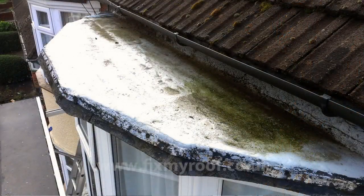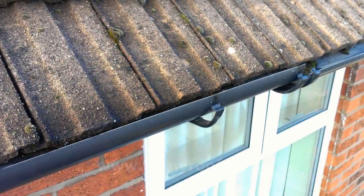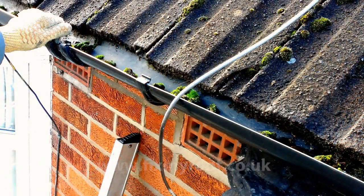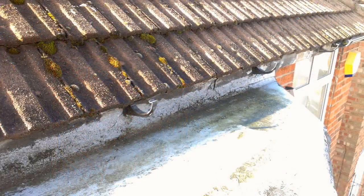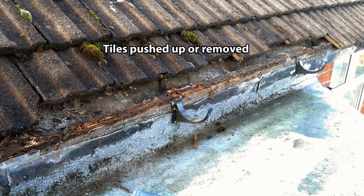It's a job done for a landlord who is very reluctant to spend any money on it. Firstly, disconnect any gutter that may be fouling your access. This is normally just a matter of unclipping any joints or unions with your hands and then sliding out the length of guttering. Next, knock up or remove the bottom row of tiles if present.